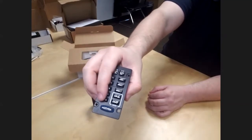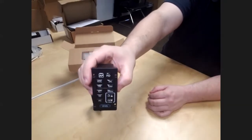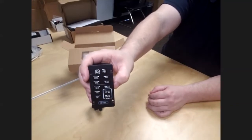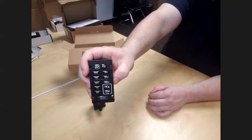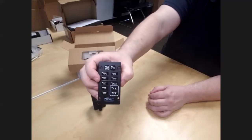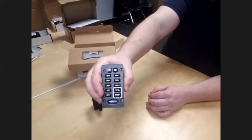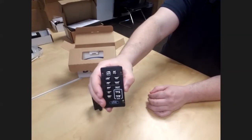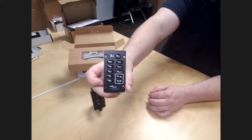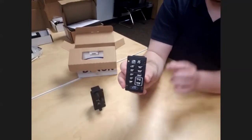Vertical speed and indicated airspeed are the two ways you can prioritize a climb. You can either set the vertical speed and the airspeed is going to be a result of how much power you're giving it, or you can set an indicated airspeed like a VY or a VX. In some higher performance airplanes, you really are flying the speedometer the whole time. So setting that to the speed you want and then applying full power or whatever's fitting is what you get. And these up down buttons are increasing or decreasing the rate of climb depending on whether you're in vertical speed or indicated airspeed. Of course, there is also the level button, which levels you out even from a pretty unusual attitude.